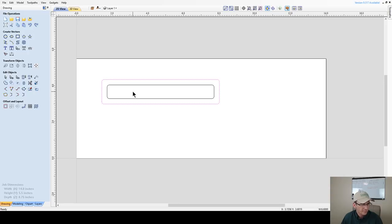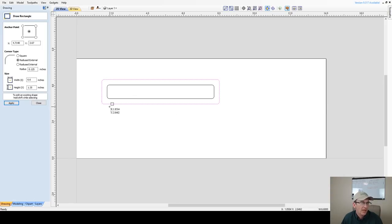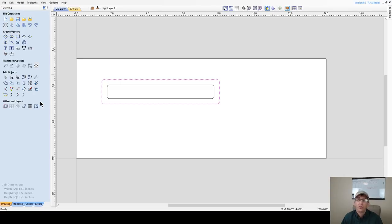Okay, now on the actual outside of the box, I could offset this even further. But I want to make sure on this one, I'm either going to do square corners if I want my box to have a square corner, and I might soften up those edges with sandpaper when it's all carved, or I might want to do a small radius. It really all depends on what you want the final aesthetics to look like. And when that lid is on the box, which you'll see in a moment how things come together, I'd like those overall corners to be not sharp, just a little bit broken. So we might use a smaller offset or a smaller radius than an eighth of an inch, but an eighth of an inch isn't bad either.